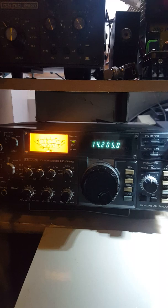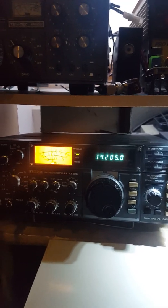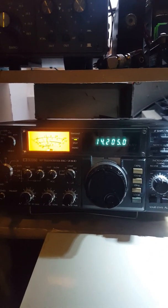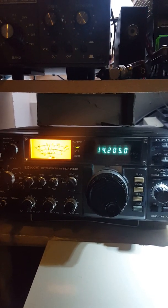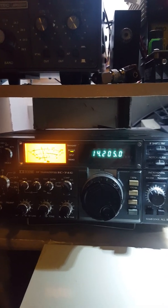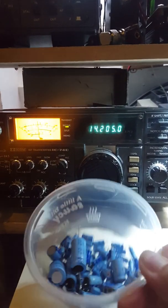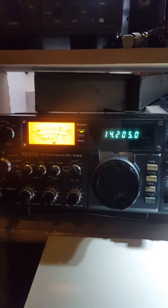In this video I will share my experiences regarding the problems I encountered. I have changed all the electrolytic capacitors. Keep in mind this radio is almost 40 years old, so normally a good electrolytic capacitor can only last maybe 10 years or more. In order to solve any inherent problems caused by leaky capacitors, all the electrolytics have been replaced, as you can see on this tab.